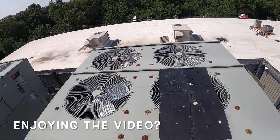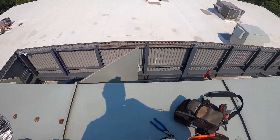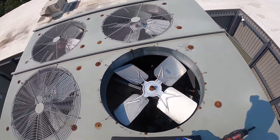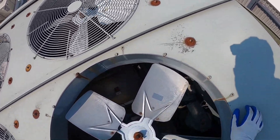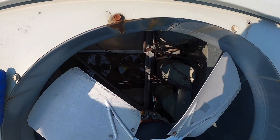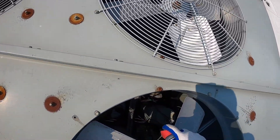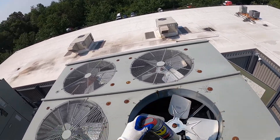I'm going to start pulling out this old fan motor. I'll move my kneeling pad — dual purpose. I'll pull this fan grate off. Now, I got a new fan blade coming — they had one in stock. General good practice: you order it up, and if you can't get it you can fight with it to get it off and reuse it, but I'm not going to bother since they had a new one. I've got to get to the bolt that holds the belly band on, which is right there — looks like a three-eighths screw head, maybe a seven-sixteenths nut on the back. Just going to give it a little spray of WD-40 Specialist penetrating, fast-acting. This video is not sponsored by WD-40.